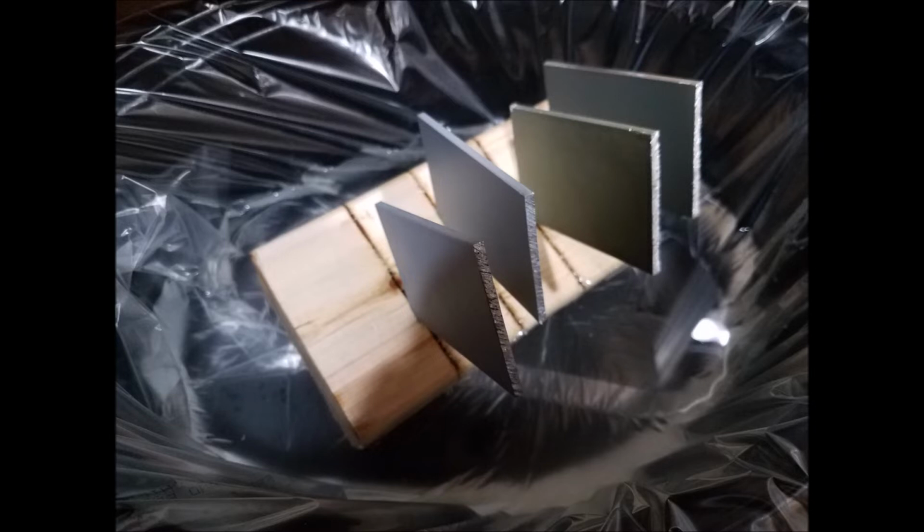And I just pulled those out because they'd been in there for 24 hours, and now they have to sit and dry for 24 hours and give a chance for any salt water condensation on them to crystallize, give it a good chance to start corroding. If it's going to corrode, we're probably going to see something at the end of that 24-hour period, and then we'll get an idea of how well the sample stood up to that environment.